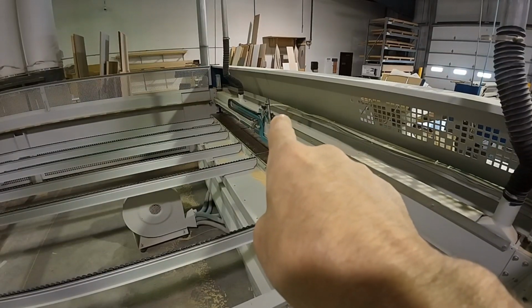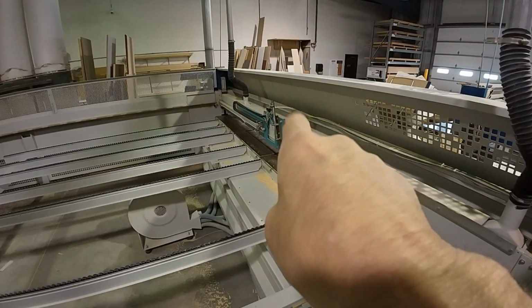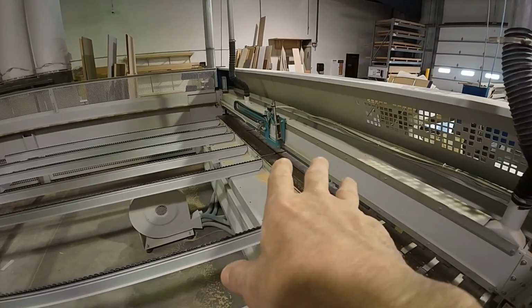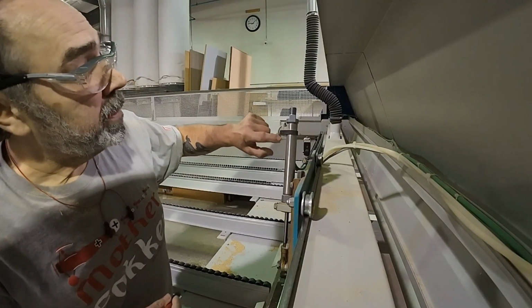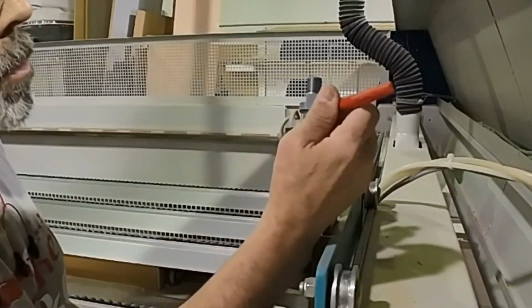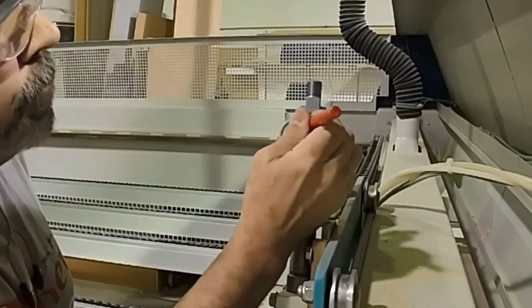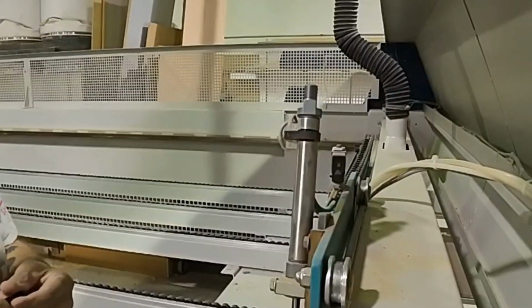So I'm going to go grab my toolbox. Basically, I only need a little screwdriver to go up there and do that, and we'll get this started. Get the machine locked out so it's secured, and then we'll adjust that sensor. On this, we have a reed sensor right here. It sees a magnet that's inside this cylinder. So I'm going to go in and mark its current position so we know where to come back to when we're done.